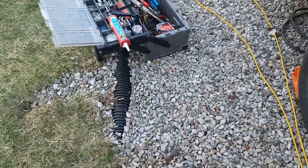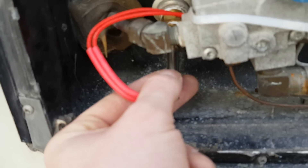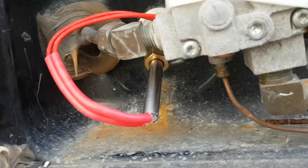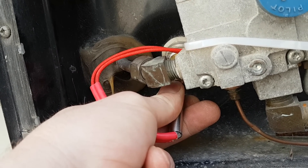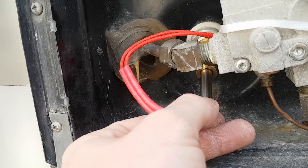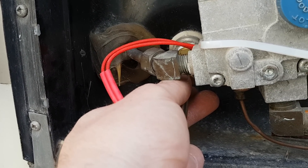Let's go outside and take a look. I got my tools and everything, just got this all wrapped and tied for now. I want to see this work, because this thing protrudes so far out — I want to make sure the element's not going to get really hot on the outside. It isn't even warm yet, so I think the element is further in. The element was like 8 inches long, so I was actually hitting part of the tank. I shoved it in so far, so I just pulled it back about a quarter inch and tightened it all up.